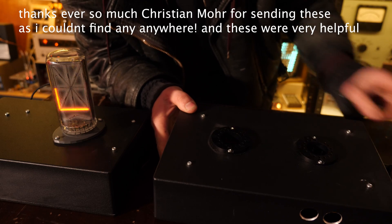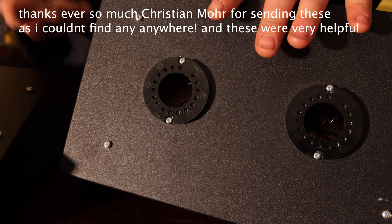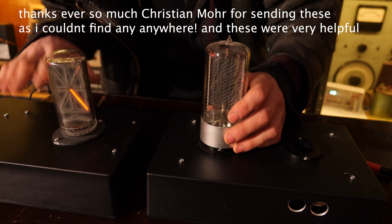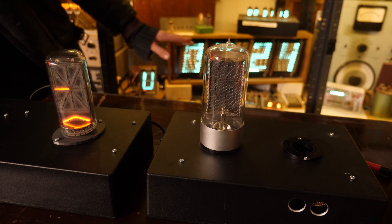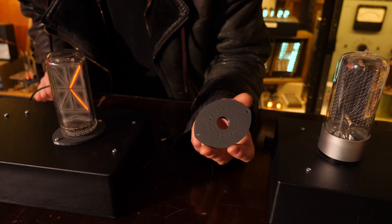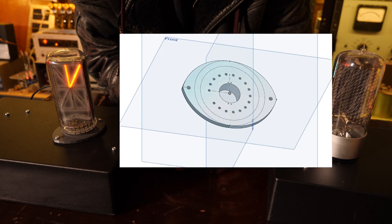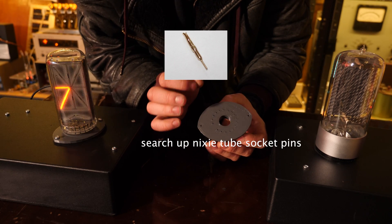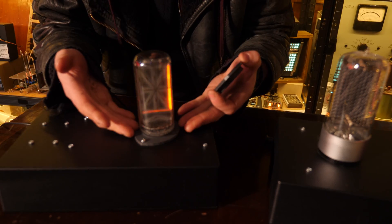With this one, there are a couple of off-the-shelf sockets — they're SK137s, that's the designation number for the socket. When I went to build this one, I just couldn't find any more — there were none on the internet whatsoever that I could find. So that's when I had to put this together: basically a 3D printed socket. I wasn't sure how it was going to turn out because it needs to be a little bit accurate, and you need to put metal pins — Nixie tube socket pins — into it to make it work. But actually, as you can see here, it works quite well.